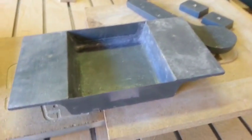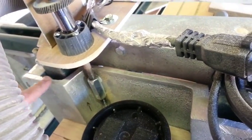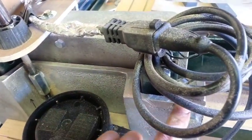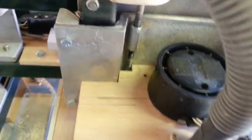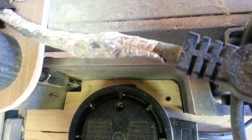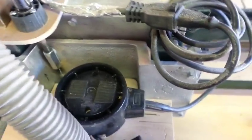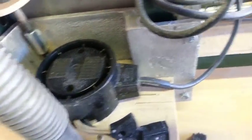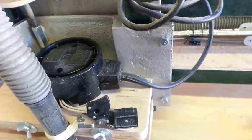It looks like a hat, but when it's all done it's just this — comes over, goes back, across here and over. It's got the Z-axis slides bolted to it, the Z-axis screw bolted to it, and the router firmly attaches to it with these wooden blocks. That was a big piece — took a big, heavy mold to do that. It looks kind of rough but it's actually quite accurate. Very heavy duty, no flexing or rocking there.